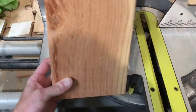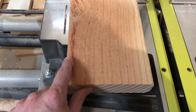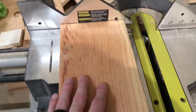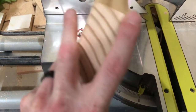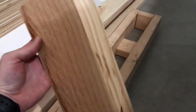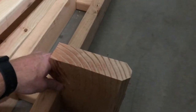I found a piece of two-by-eight and cut it to about eight and a half inches tall, then cut it down to only about five and a half inches wide. With the particle board and tile we should be at about twelve inches out from the tub. Now I'm going to knock the corners off at a 45-degree angle with my miter saw so I can put a screw in the middle without affecting the rounded edge. The particle board will start at the middle piece and curve to the edges.